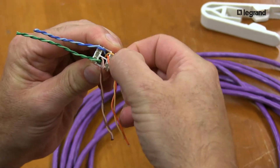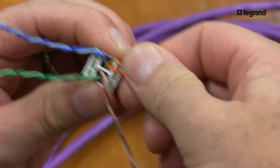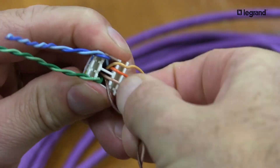This is the point where you just have to pull into the grooves. As long as you have a little strength to pull that down, that's going to help you out. You don't want those leads floating above the grooves, otherwise you could have some opens inside your IDCs.